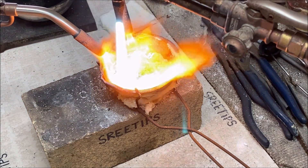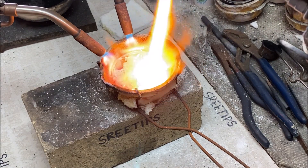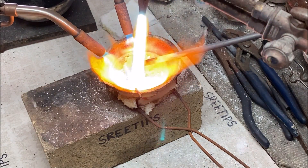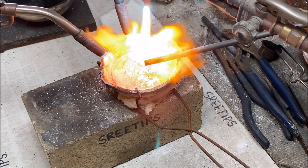The oxy-acetylene flame is about 6,000 degrees Fahrenheit, so adding that additional flame will speed the process. Here I'm going to pick up a graphite rod and preheat it in the flame, and then we're going to stir the metals to produce a nice uniform alloy.